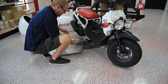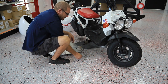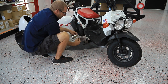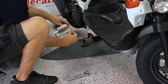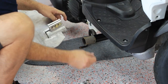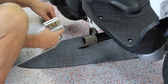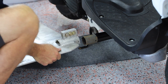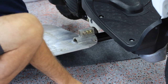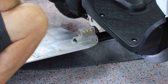Once you have the jack leg and wheel installed, you'll need your 7/16ths open-ended wrench and 7/16ths socket again. When it was shipped to you there should be a 7/16ths inch bolt through here — take that off and set it aside. There's a pre-drilled hole in the bracket and the hole you just removed the bolt from; slide the frame onto there, line up that hole, put your bolt and nut through, tighten that up, and you'll be ready for the next step.